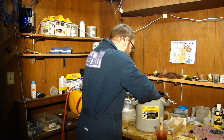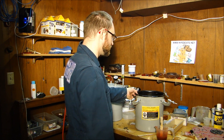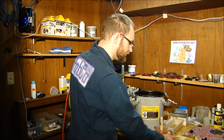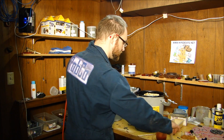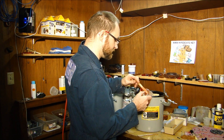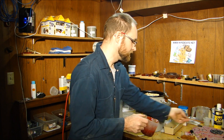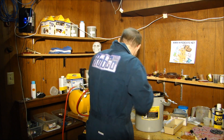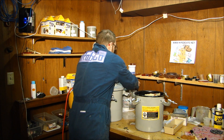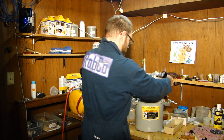Most of my molds and mold boxes I don't really care if they're level — if I'm doing a two-part mold you clamp it anyway, and for a one-part mold I can always adjust and balance things inside the pot. So I've got a part here — this is part two of a two-part mold. I've got my rubber mixed up already, and I'll just set it in here and pour this in. Then all I have to do is take this lid — it's got a big rubber seal on it — and put the lid on.